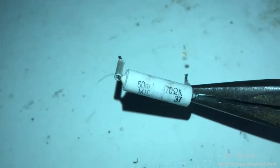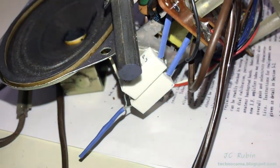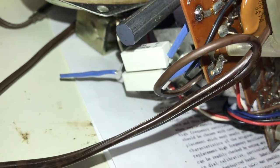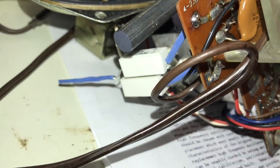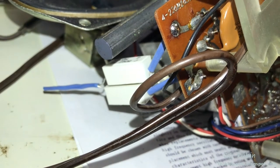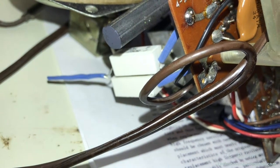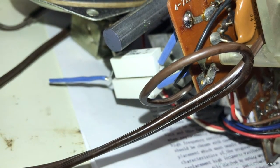I wanted to see, given the increase in voltage that we have today, I happen to have a couple of 250 ohms that I tied together in series to make a 500 ohm. The benefit to these 250 ohm resistors is that I could put them in series to get a 500 ohm resistor, and both of them are 5-watt resistors, though one of them is going to be used to do most of the voltage dropping. So one of them is going to be consuming a good portion of the power. The other one's not really going to be. So in actuality, only one of them is going to be acting as a 5-watt resistor. The other one is just going to be a misaligned 5-watt resistor sitting in there. But that's fine for our purposes right now.